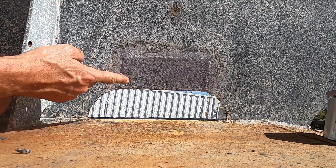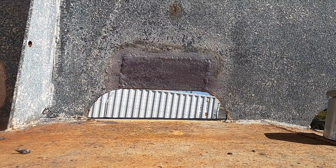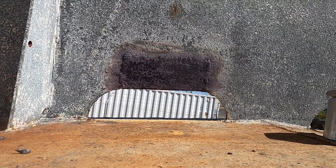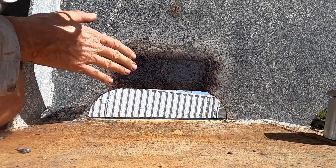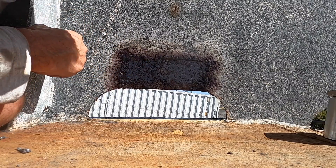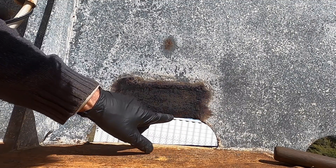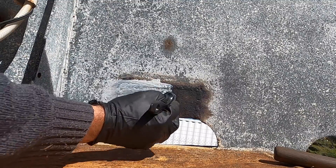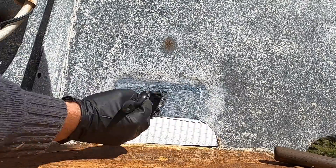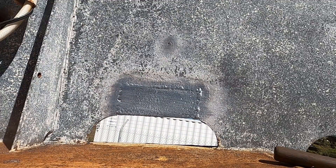So this isn't just a paint, it's a converter. Slowly you'll see this change to a real sort of black-bluish colour, which is the ferric tannate from the oxide that was the reddish rust colour. I've sped this film up to eight times so you can see how quickly it does react, but I would leave it a good 24 hours before deciding whether you need to add more or whether all the rust is converted. Sandblasting is a bit of the gold standard to get rid of this sort of surface rust, but for average guys like you and I, this is a pretty good alternative. You can see there's still a little bit of rust colour, so we need to put a bit more rust converter on. I'm going to give it a light brush first, then put a second coat on. After that, there should be enough to do some priming. We'll let that sit for another 24 hours and it should be good to go.